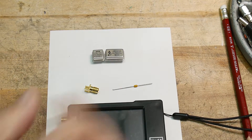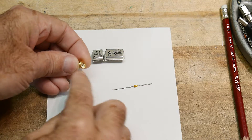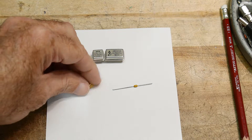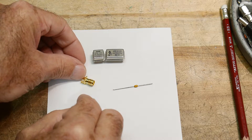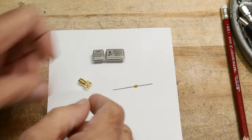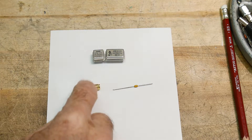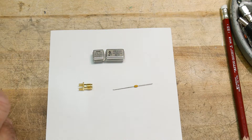You'll need three things. First, you'll need a connector of some sort to connect to the TinySA. I've chosen one of the cheapest options I can think of: a PC board mount SMA connector, which will allow us to use a cable between it and the spectrum analyzer. Then you'll need an oscillator — some type of RF source.